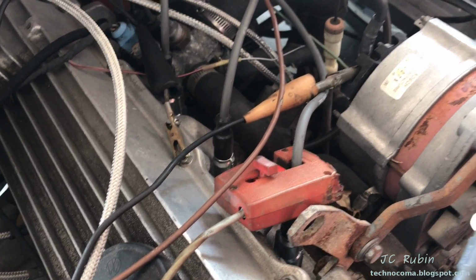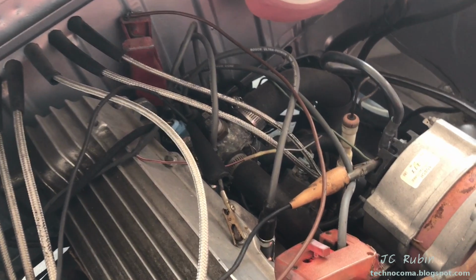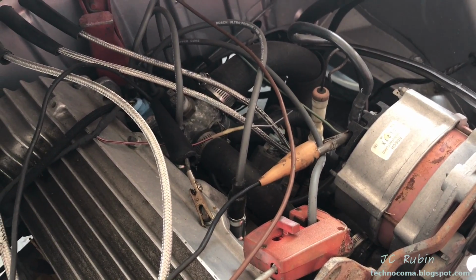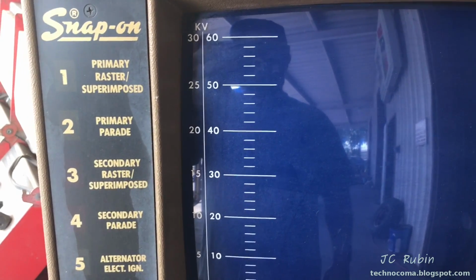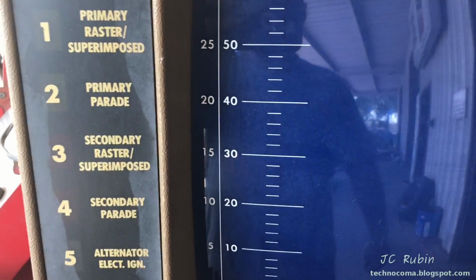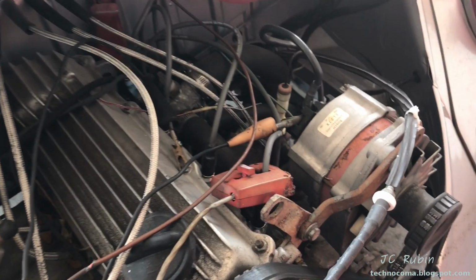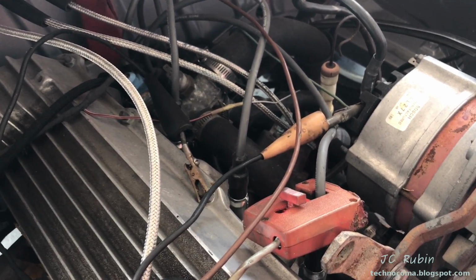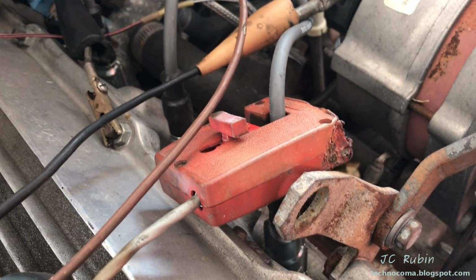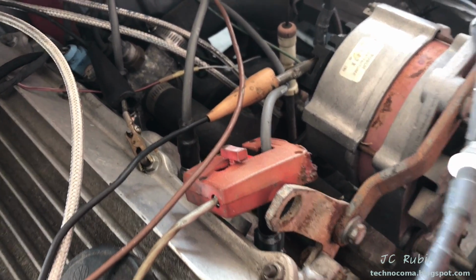We've been measuring it for how many henries it was earlier as inductive. What wasn't readily apparent was that the fact that it was inductive probably meant that it wasn't being used for any of this at all. But shortly after I started doing these tests, I started to question this and ask why we would be using this for the secondary if it's inductive. So I started doing a little bit of research and some tests. I started connecting and disconnecting this from the primary while the primary test was going, and saw absolutely no effect, which obviously was expected if it didn't work in the first place.